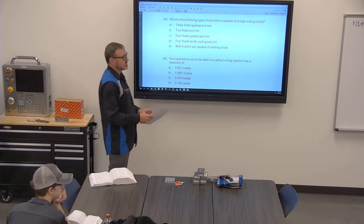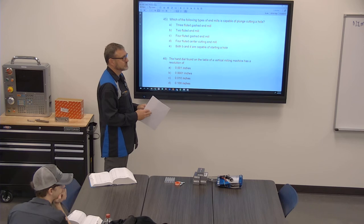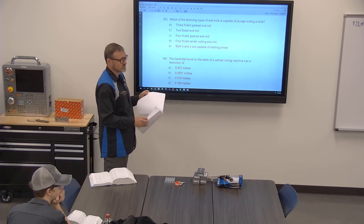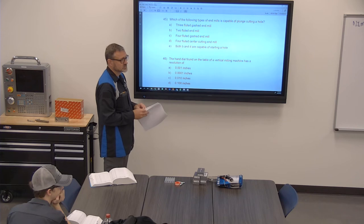Yeah. And yes. Real quick. Can I get this to fit in this? The 3/8 collar. Is it 3/8? It's supposed to be 3/8. You measure it. It's like 380. Which is not 3/8. It's like 387. Yeah. It's a little over. Yeah, it's 12 thousandths over. Think that'll work for this?